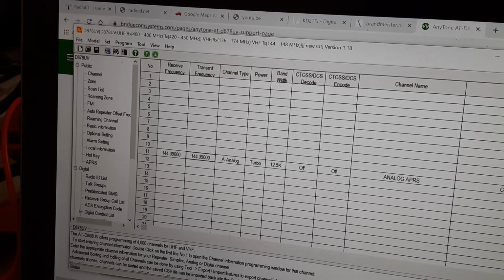My mobile radio is way more powerful. It goes up to 50 watts. I can get to the repeater in Brooklyn or in most areas pretty easily with my mobile radio. But if I'm outside the area, let's say I want to take a road trip, I'm going further away, I'm outside of that coverage area, I don't want to have to deal with having more code plugs and more repeaters and zones and stuff like that. I'd rather have just a few zones, few areas, and if I'm using my hotspot, as long as I have my cell phone on, I'm going to have that using my internet off my cell phone or whatever the heck you have.